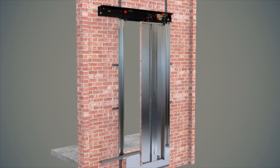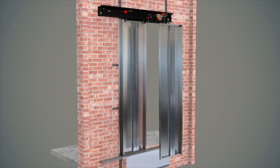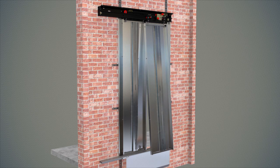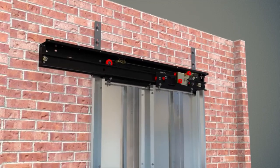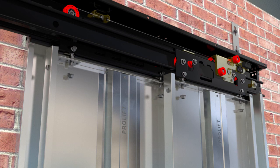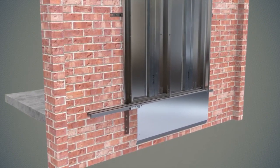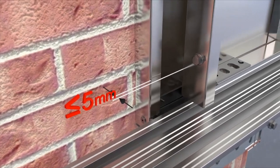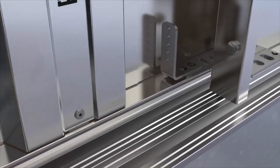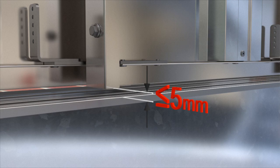The holes at the head sections of door panels are aligned perpendicularly to correspond with the panel suspension. Panel fine adjustments are made at level, then the assembly of panels on panel suspension is completed by screwing washer head hexagon head metric 10 nuts. During the assembly of door panels, make sure that the gaps between frame, panels, and sill plates are five millimeters or less.